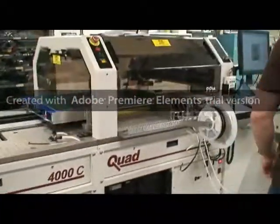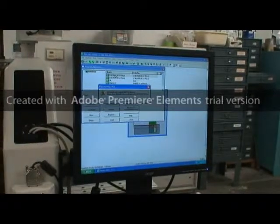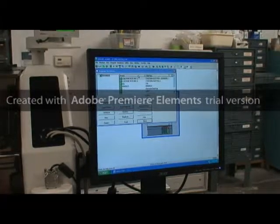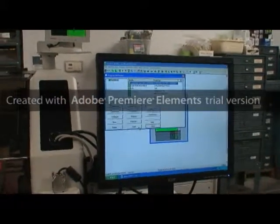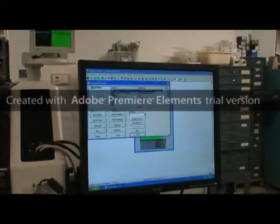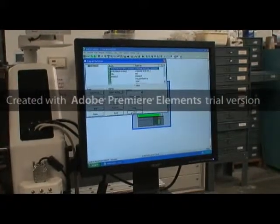The next step is to load the program. I'm going to select our program — the first part — and make sure our boards are cleared from the previous run. We have a two-step program to index the workboard holder in the first half. We run program one, complete it, and then index the workboard holder in again and run the second part of the program. Now that my board is loaded, I'm going to do a changeover, select all, make sure my feeder is in the right place, and then go into run mode.